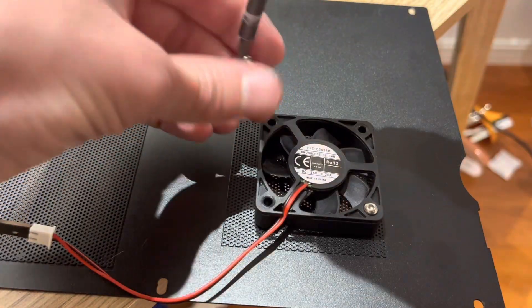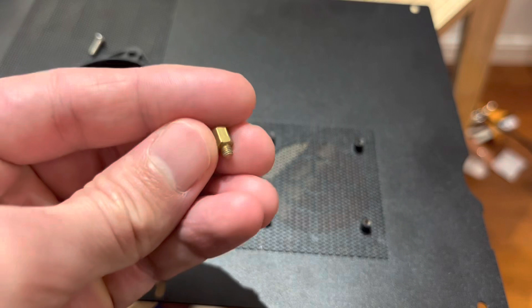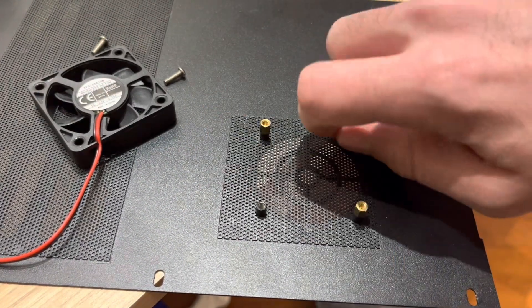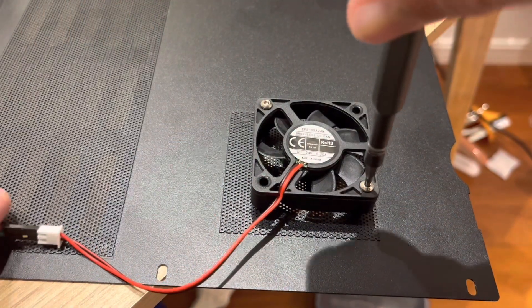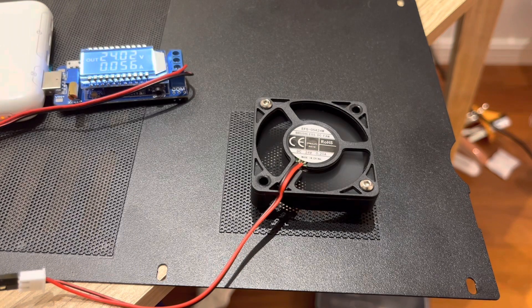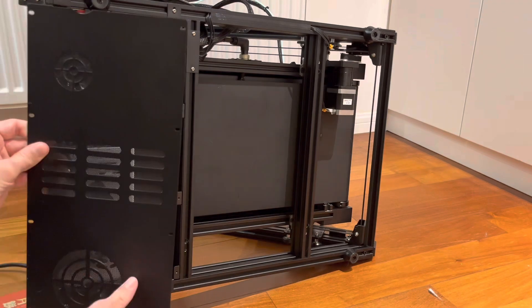I think I've got a pretty simple solution here to quiet the fan down and get some more airflow. I'm going to remove the screws and put some 5mm brass standoffs underneath the fan. With those standoffs in place, that'll give a 5mm gap between the fan and the metal mesh. And now we can hear from the results that the fan is significantly quieter.